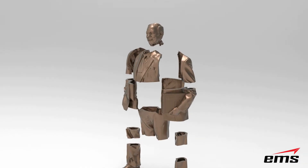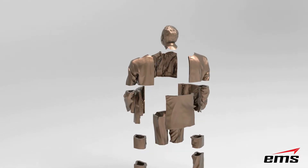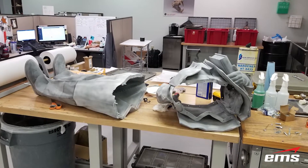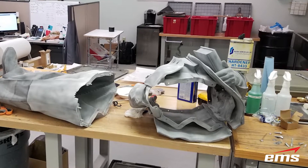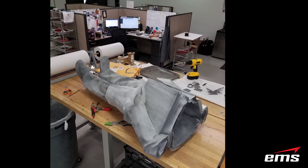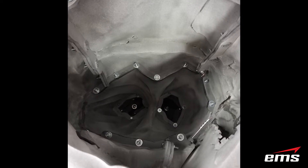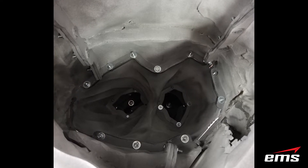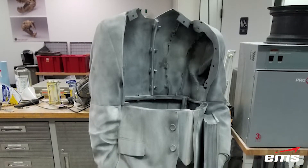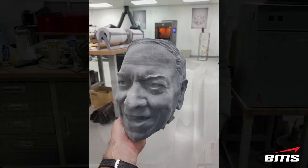We also had to come up with a fastening system to put it all together so that it could survive not only being shipped, but being put on display and lasting for many years. It took a little time to figure out the best way to cut up the file, not only for 3D printing but also for assembly. Everywhere we cut the model, we added a flange with holes on both sides so we could bolt it all together. We used an adhesive on the flange, which gave us a large surface to glue the two halves together, then put nuts and bolts through to bolt it as well, making it extremely strong.